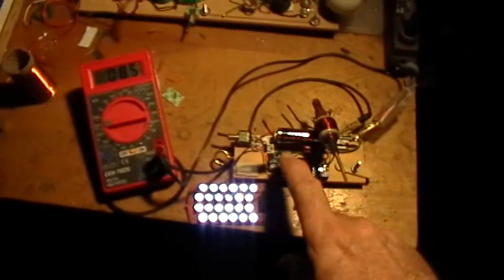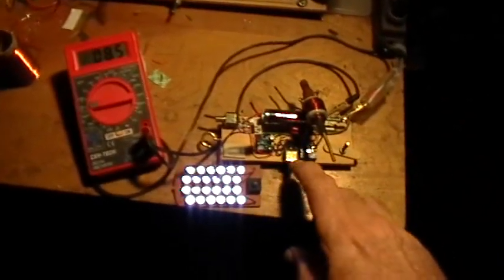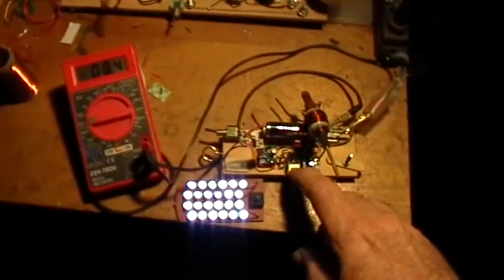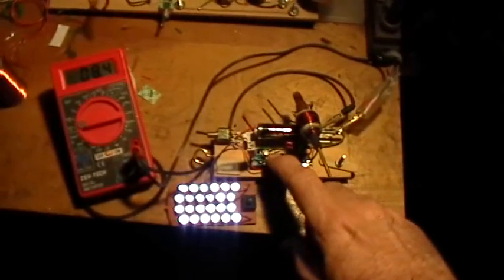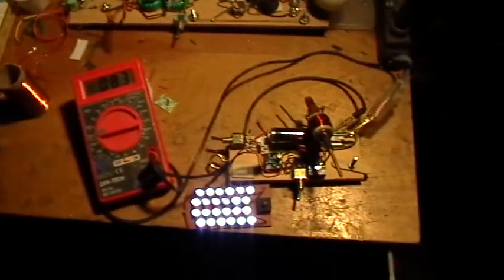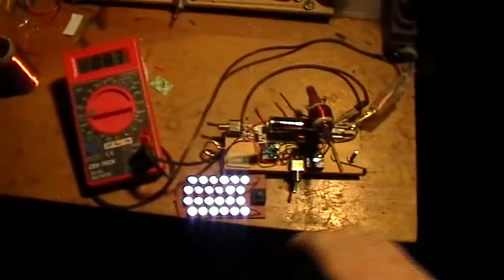I found that if the battery voltage is too high, the system actually won't run in the normal jewel thief mode — I think because the transistor saturates. The current drain goes up to about 50 milliamps when that happens, but the lights don't come on.